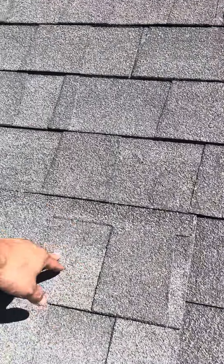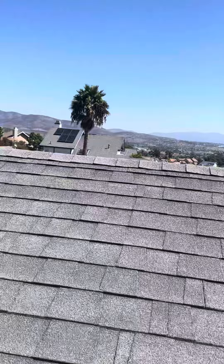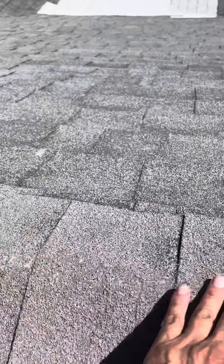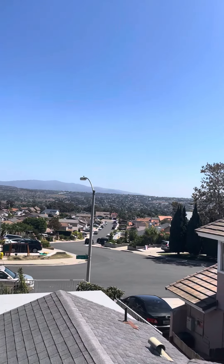You can see this minor repair with a different type of shingles. This area looks a lot newer, but you can see all the granule loss and fiberglass showing right here across this entire area. The fiberglass is exposed, which means all the oils have evaporated from this material.